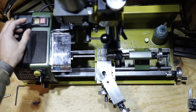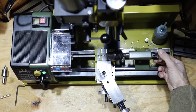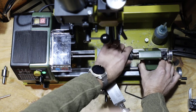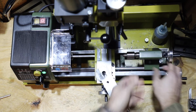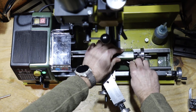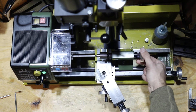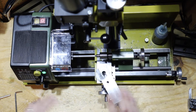Now we want to get ready to power everything on. We're going to put on our safety shield, turn the power on, start to spin our aluminum, and drill a little notch. That's all you need. Now we'll back that out, remove the drill bit from the tail stock, and replace it with the center. We'll move it right back up into position and tighten it down. Tighten the center until it gets a nice grip — you don't want to tighten it too much because you might bend the aluminum. It's only a quarter inch thick, but you just want it gripped and centered nicely.